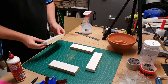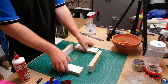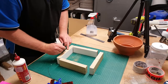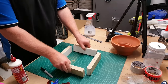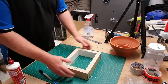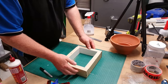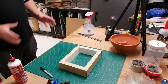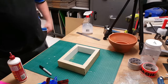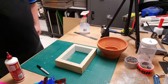Once you've got all these ready, it's important to keep in mind your bottom edges — I'll mark them just with a dot. As you put these together they fold in like that. As you can see there's no way that a piece of glass is ever going to come in contact with a dam; it's fiber paper all round. This goes on a piece of 3mm thick fiber paper and then onto an unprepared kiln shelf. You don't need any kiln wash; you don't need to kiln wash your pot. We just clean it to get the ceramic dust out of it. Fill it full of glass and fire it up.